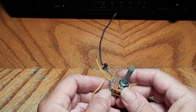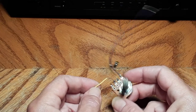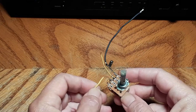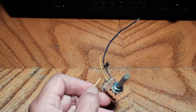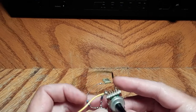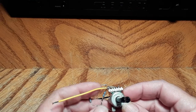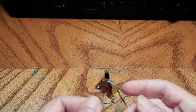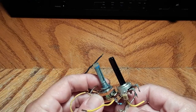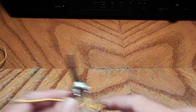You just have to wire this pot into the existing circuit, which is a whole other conversion I can touch on sometime — with what those actual connections are and the flipping of those connections to get them into one of these pots. This was the original D-shaft that came out of it — it's a real piece of garbage. It has all kinds of tracking errors on the lower end of the pot on the wiper, just like a lot of pots do, but maybe this one's a little bit worse. Mine might be a tad bit shorter in shaft length.